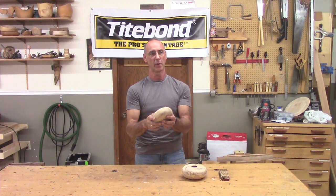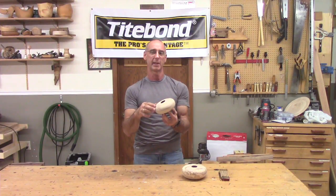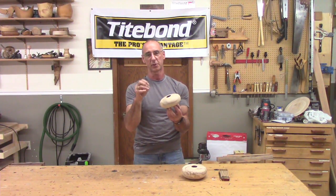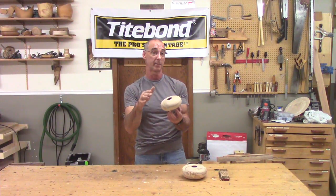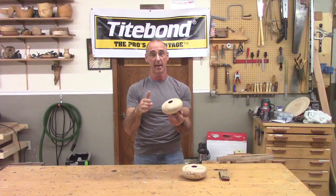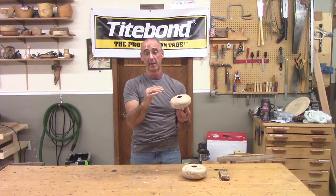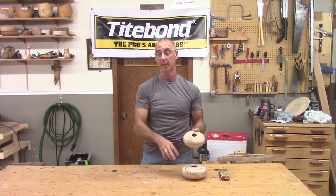It's difficult to work with because it's a little bit like machining stuff in the cottonwood and the aspen family. It's got a stringy grain, and so it doesn't always plane superbly well. So you might end up planing to a certain extent and then taking care of the rest of that surface with sanding, because sanding will be easier on the stringiness than planing will.